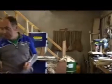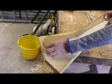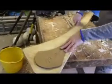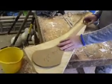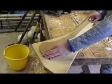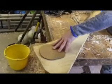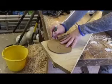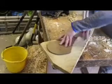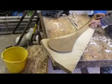As I say, the one I have today is a 28 inch Hurley, so I'll just get a standard 28 inch template. I'll set down the handle, and because the grain is coming up the plank at a little bit of an angle, I'll keep my handle at a little bit of an angle as well, just to follow it. Now you never really know what you're going to get until you mark it. When I mark it, I get a little look at it, and then I'll know exactly how we're fixed.